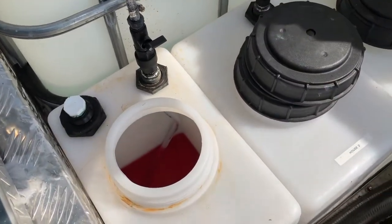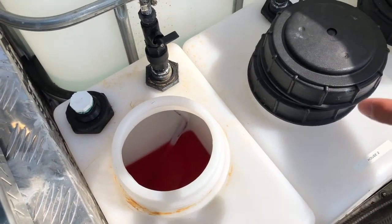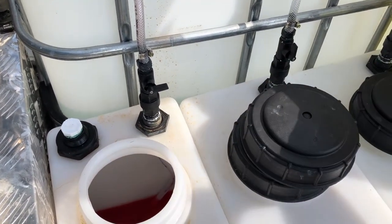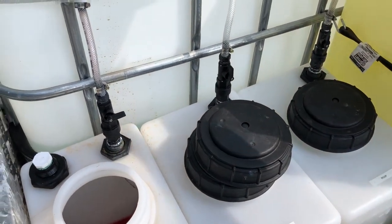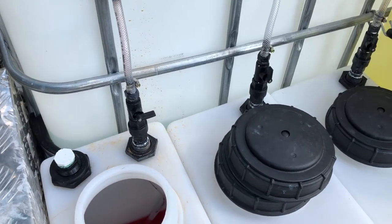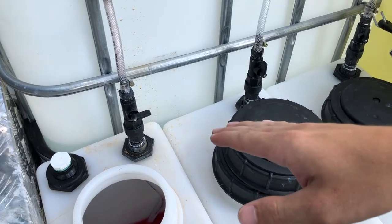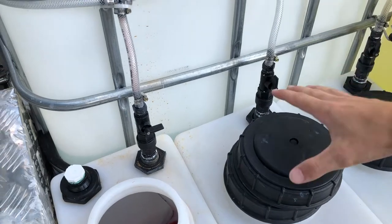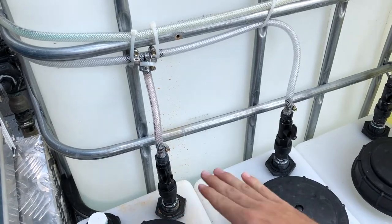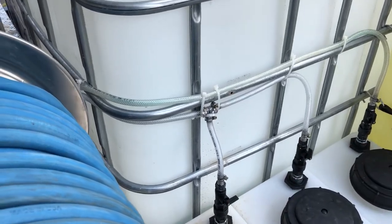Let's follow the flow of chemicals. Inside the tank the chemical goes into a filter, then up a quarter-inch hose to a check valve. This check valve is very important — it's at the top of each tank and stops chemical from flowing back down the hose. When you turn the ball valve on, it can take time for chemical to come through, leaving inconsistencies in the hose. The check valve keeps the line full of chemical and ready for the metering system. We then have micro ball valves to control which chemical comes out.